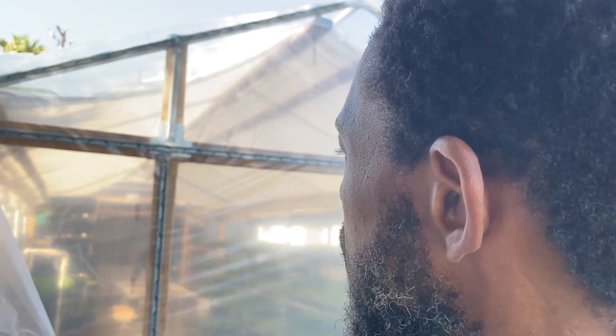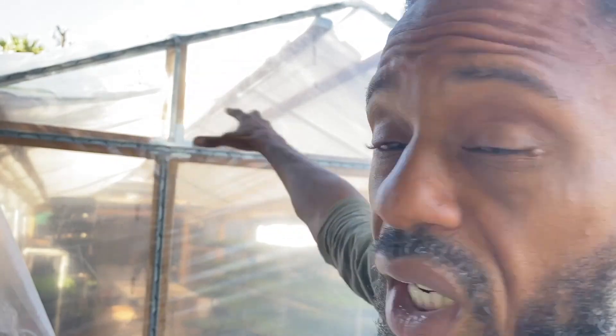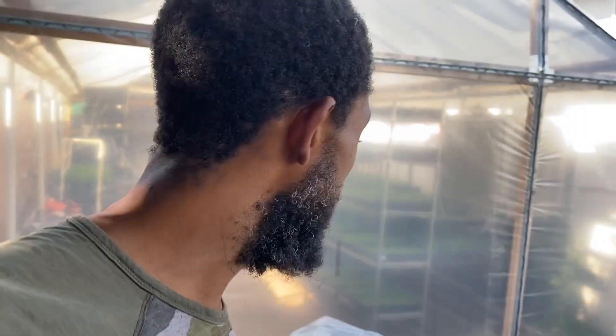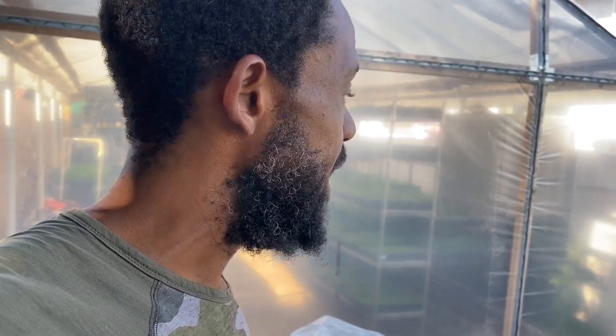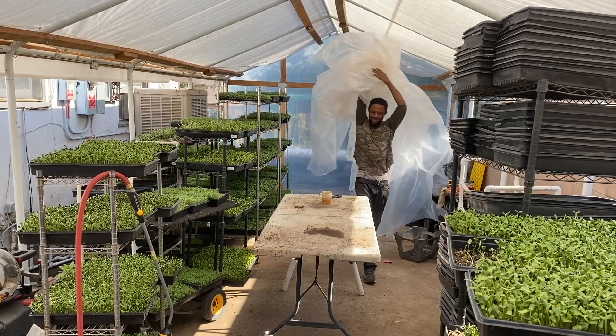For all intents and purposes this side is wiggled and locked. The goal is to do the two end walls as well as cover this whole structure twice — I want to have two layers of poly over the middle section so that we can insulate it later on. Now I need to take this plastic and put it across to the other side. The other side is a little more cumbersome so I'm thinking I'll do that side in pieces as opposed to one solid piece.